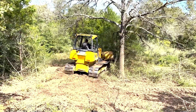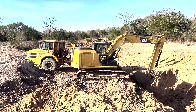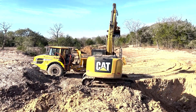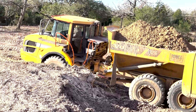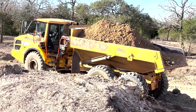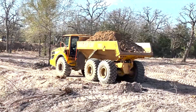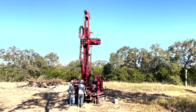Select fill is not expansive. It doesn't contract when it dries out. It's really, really stable. We mine it in clay pits around the area and bring it to the building site. It's not that expensive per se, but you're spending money on dirt, and the real expense is the fuel and trucks to haul it all. We've got hundreds and hundreds of yards worth of dirt to make this hill where we're putting the house, and that would have been cost prohibitive. So we thought: can we take the clay we're mining out of this pond and use it to make this pad, and save all those trucking costs?